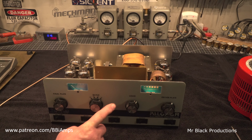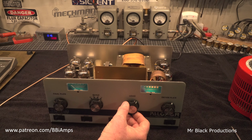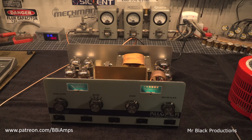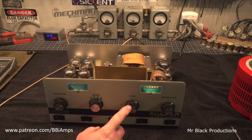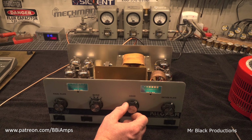You know what, here we'll use this knob as an example. That's our set mark right there. Watch. Hello. There's 600. Okay, this is the most in tune this box is ever going to be. I bet you if we had 100% tubes in this, it would do about 800 watts, but hello. One needle's width here equals 200 watts here.